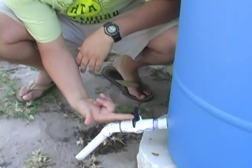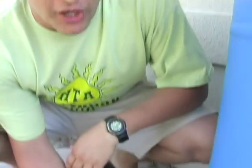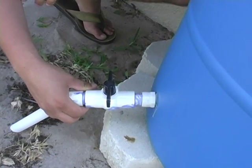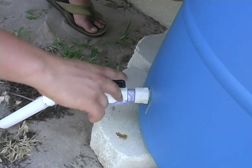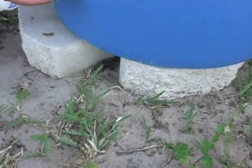The next step is exiting water from your barrel. Use a hole saw inserted into the barrel. At first we considered a hose nozzle for high pressure output, but we ended up using a ball valve, which increases the pressure and capacity of the water a lot. Make sure your barrel is up on a platform so it can be gravity-fed to where you want it to go.